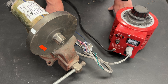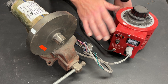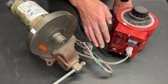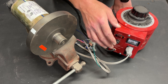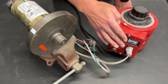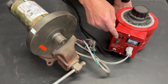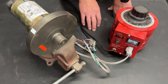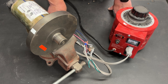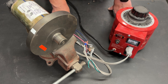If you're doing any of this at home, you are doing it at your own risk. The last thing I want to mention is: if your motor comes with blue wires, it's probably a lower quality motor, and depending on the application you may want to consider getting a better motor. Typically — not always, but typically — motors with blue wires are not as robust, they don't have the torque, and they're designed to run at super high RPMs. Because of those two things, it is very easy for them to overheat, and so the blue wires are there not as an extra feature but as a safety feature to keep you from burning up the motor. So if your motor has blue wires, it's probably not the best option depending on your application.